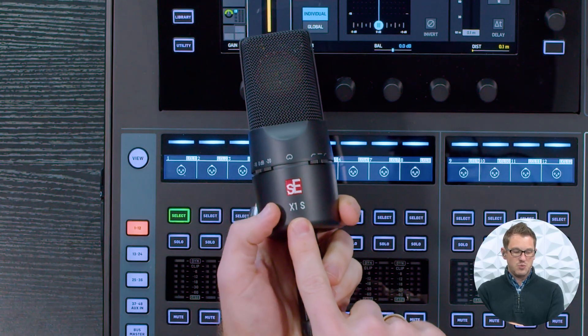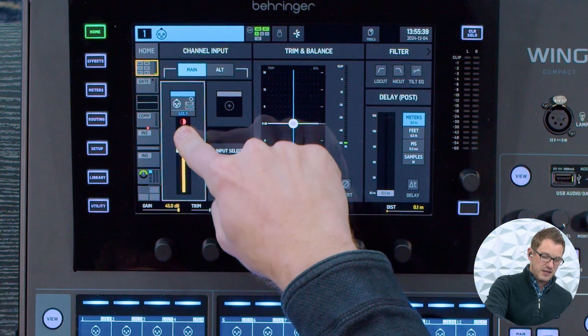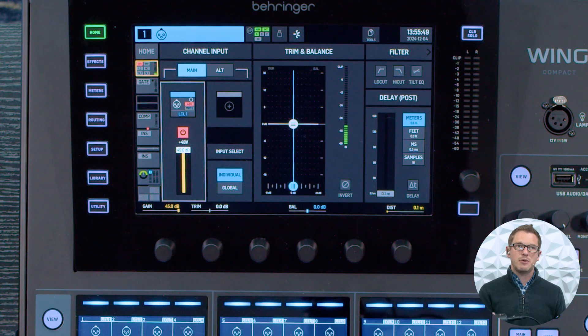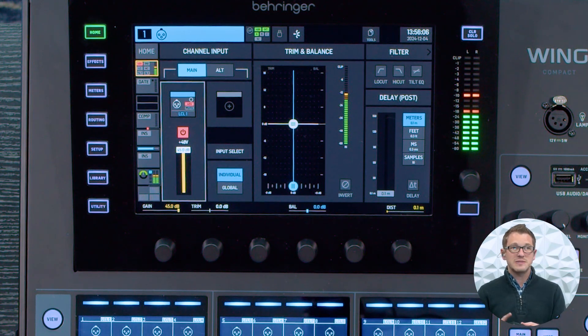Find the manual of your microphone just by looking it up. This is an SE Electronics X1S, and if we search up what type of microphone this is, it's a condenser microphone. These condenser microphones require phantom power to be turned on. All we have to do is press and hold our phantom power button to enable it. The Behringer Wing also mutes the channel as it's applying phantom power, because if you apply phantom power with a channel unmuted on some other consoles, it will send a little pop through and your musicians might hear that and it might damage their hearing. So now that we have phantom power turned on, we can hear that this microphone works.